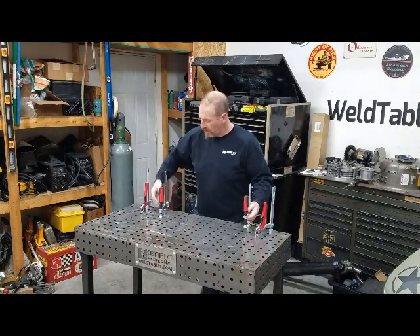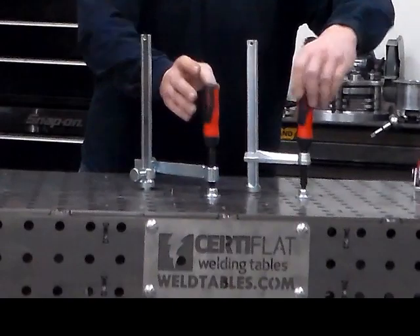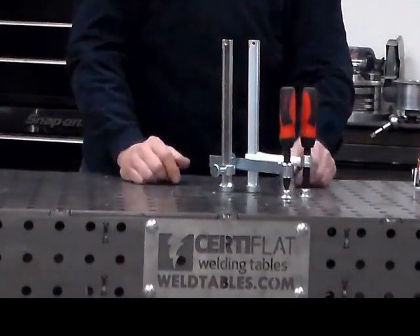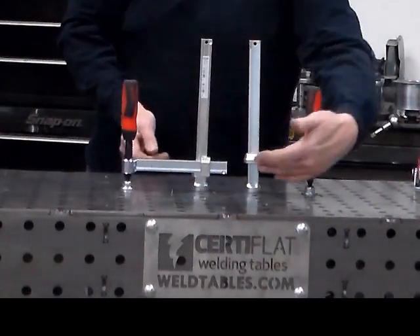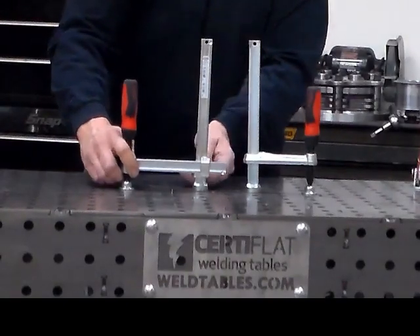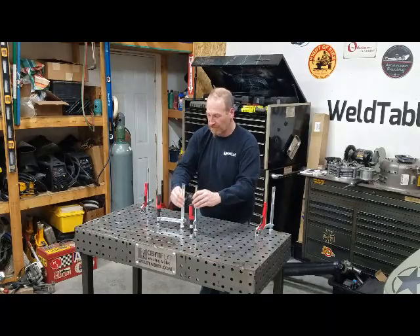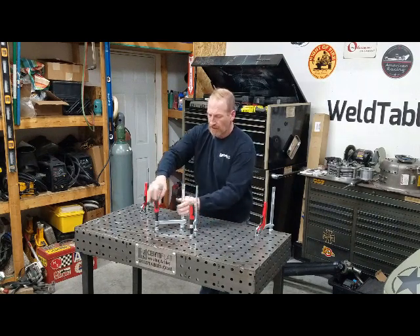Next up, we've got the same thing with a slightly different handle style — a poly handle, straight up and down. This allows for better access in some situations than a T-handle. In a case where you're going to have two of these stacked right on top of each other, a poly handle can be beneficial. Same as the T-handle, you've got a fixed throat version at about four and a half inches and an adjustable throat version which spans up to about six inches. Heavy duty cold forged rail, nice hardened peg, welded assembly — but a poly handle.